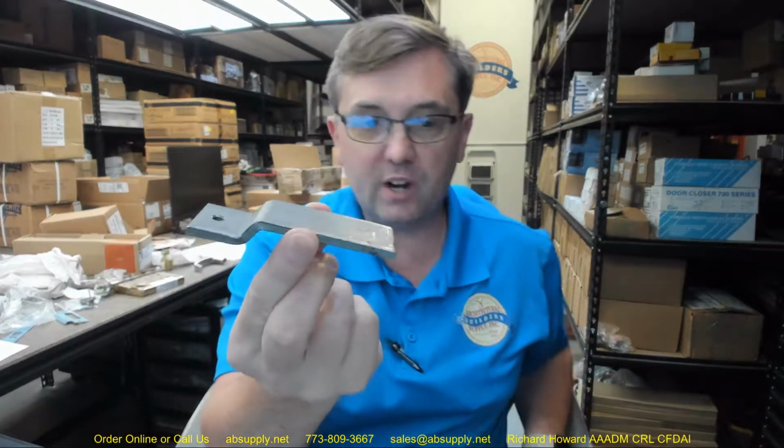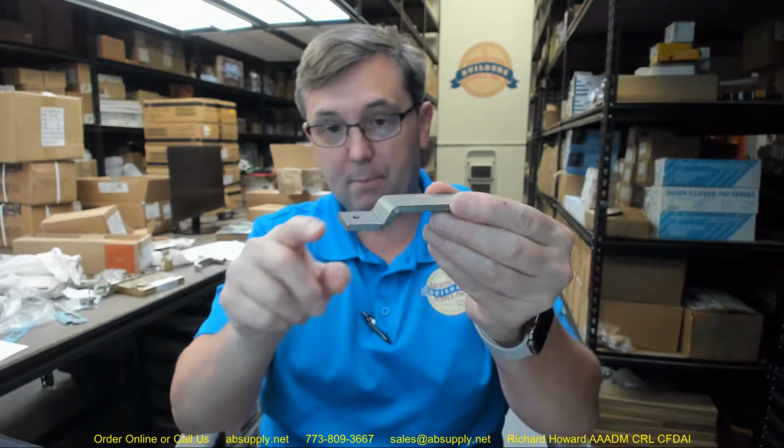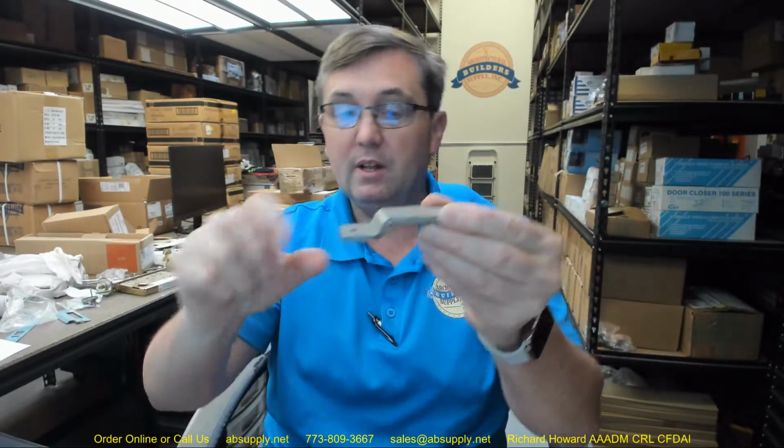And how to compensate for something thicker? Well, I might pad that from the underside of the throat of the frame to lift it the thickness of what I needed to pick it up as. Back in the shop, they would be smacking this to change the offset to compensate. That's just not the way to do it, because inevitably you're going to have a compromised plate that is not going to have the proper offset. It's certainly going to be bent at an angle, and this is 3/16. So you're better off shimming that with something that you can weld and make it part of the structural integrity of this, okay? Depending on the thickness. If it's 16 gauge, I think you're going to be in real good shape.